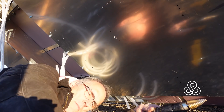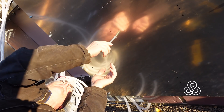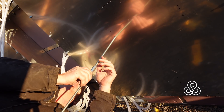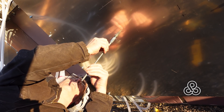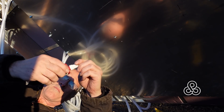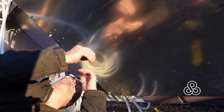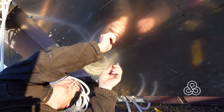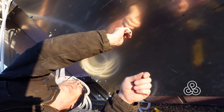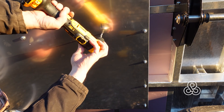We are going to make center supports going through here. There are tanks on both sides with about a four-inch gap between them, so I'm drilling these holes and pushing this rod through the insulation, then finding that threaded coupling fastened to the bottom of the floor. I couldn't quite get it threaded in at first, so I put a little extension on there and was able to find it and get it threaded in. Then we'll put a larger washer to spread the weight out and add some red Loctite to make sure these things don't pop off, because they're going to be way underneath the chassis and a little more difficult to get to. This will occur on both sides of the tank about 16 inches apart.